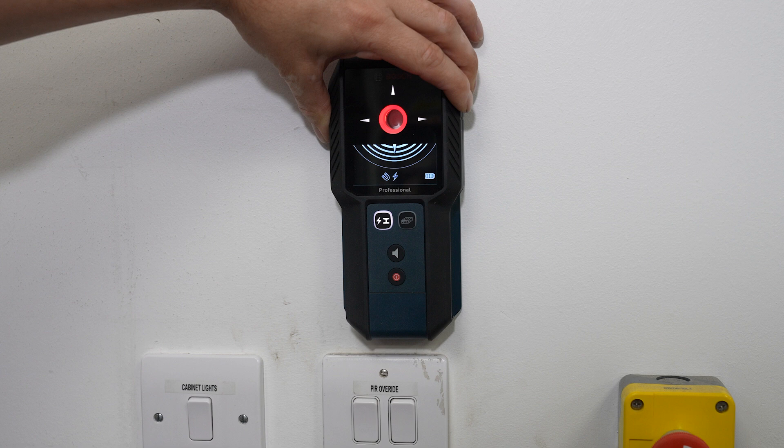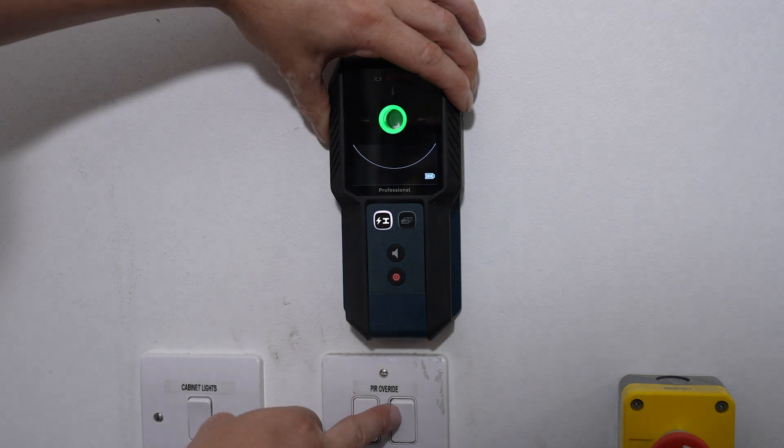To vastly improve live wire detection, ensure current is flowing by switching on electrical items such as the room lights or other appliances connected to nearby plug sockets, in order to produce a sufficient electric field to surround the wire for the GMS to find. Please bear in mind that in certain conditions, live wires cannot always be detected, such as behind metal surfaces or behind surfaces with high water content. Please consider this when assessing the working area prior to scanning. The tool can only operate in no more than a maximum of 90% non-condensing humidity for reliable detection of objects.